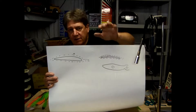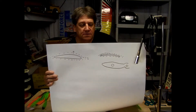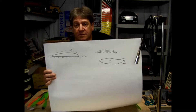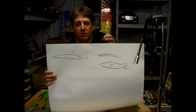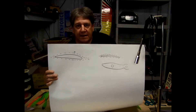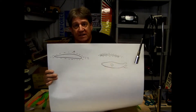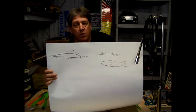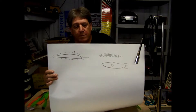Now I know we're talking about a small area on the propeller, but it is going to disrupt your lift ever so slightly. If you're listening to a propeller and it's making a flappy sound, like a baseball card in a spoke kind of sound, that's turbulence, that's inefficiency. When your props are running smooth and you can't hear them, that's when they're working their best.